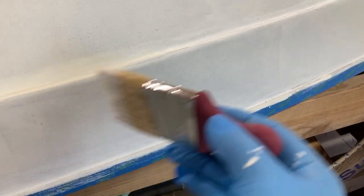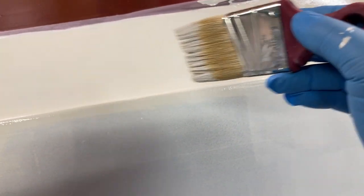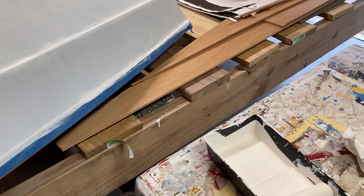And we do about as far as we think we can do with the next little bit on the roller. Today, with these temps and how we've thinned it, we think we can go about, on this skinnier plank up here, 2 feet at a time, roll it, and then feather it back in. Down here, it's getting a little wider, so we'll probably do about a foot and a half. And let's see if I can put a big X on there, so I know about how far I'm going to go.